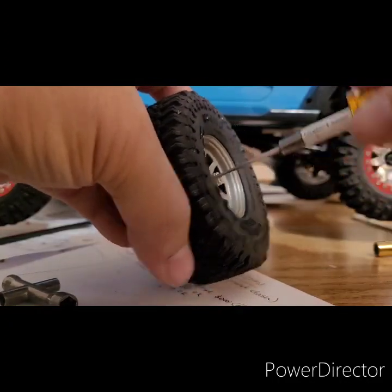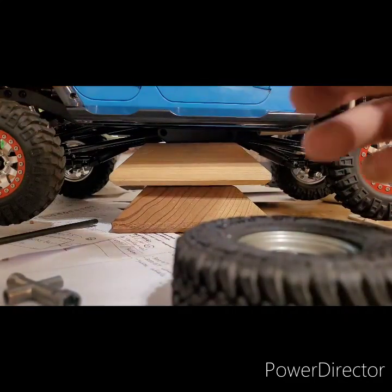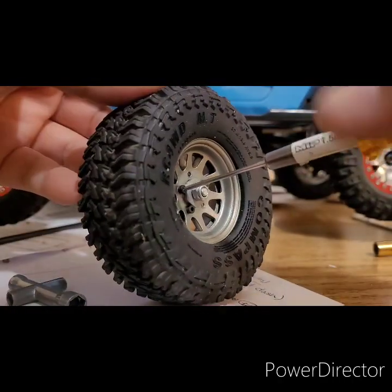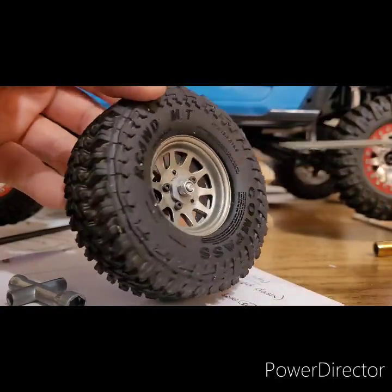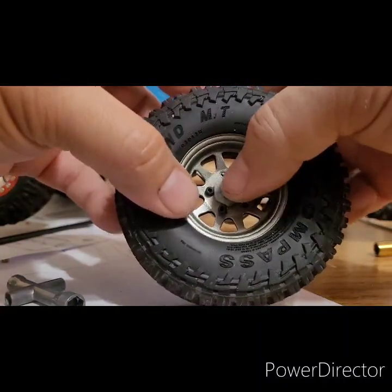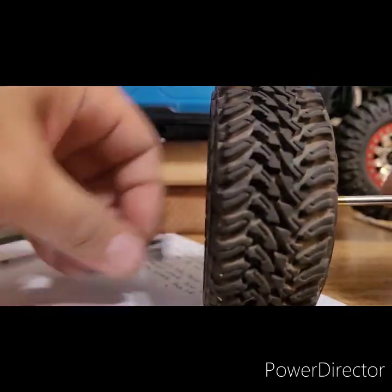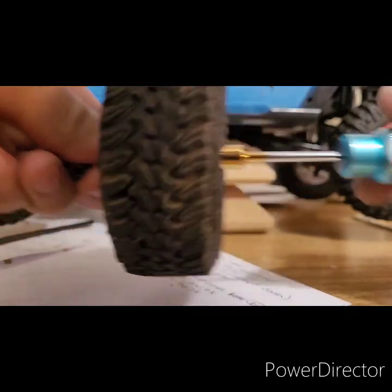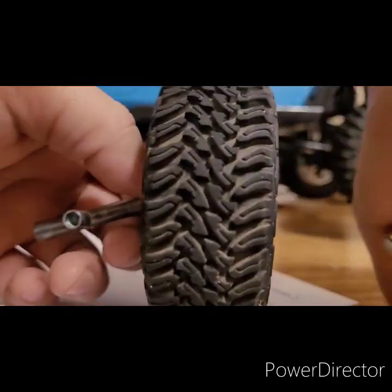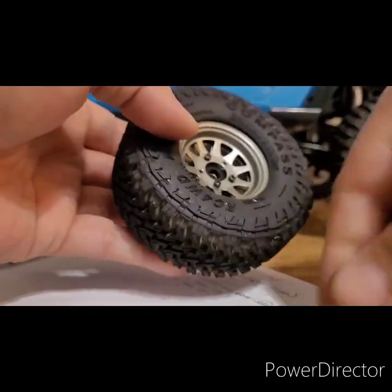So I basically go in a star pattern. I don't know if you can actually see what I'm doing, but that's what I'm doing. So the screws started to catch, and basically I have a little triangle now of screws. Now if you notice, once you start to get going, the middle should loosen right up. As soon as it loosens up, go ahead and remove it so you don't have to work around it anymore. Now once you go ahead and remove that, go ahead and add the other two screws, because remember you just put in the 3 to triangulate the piece.